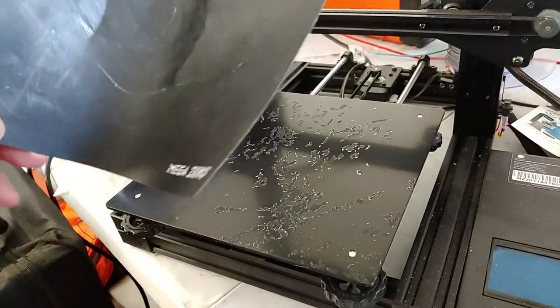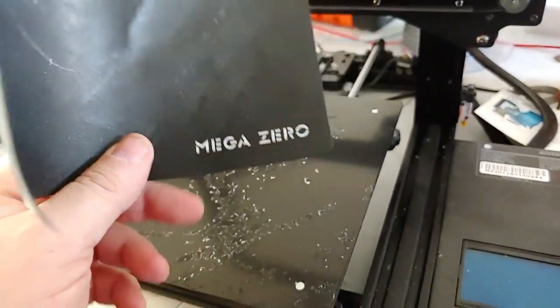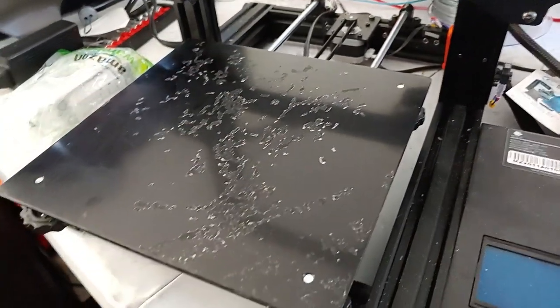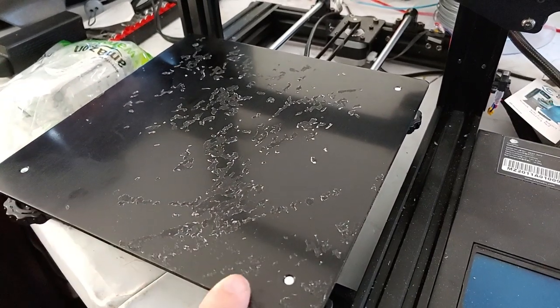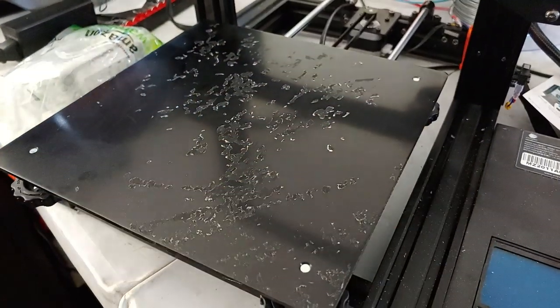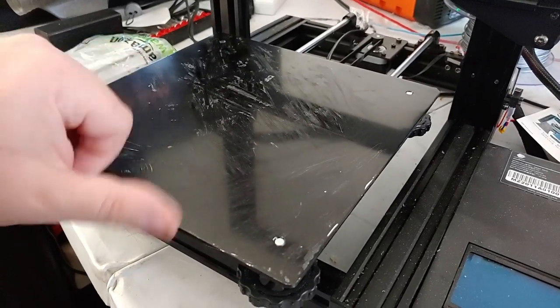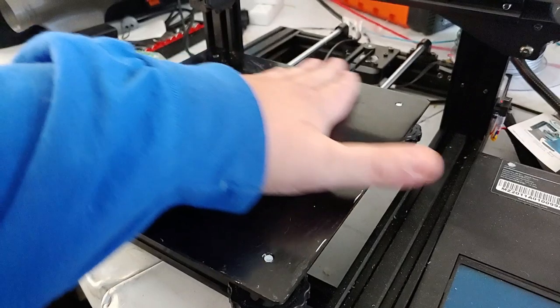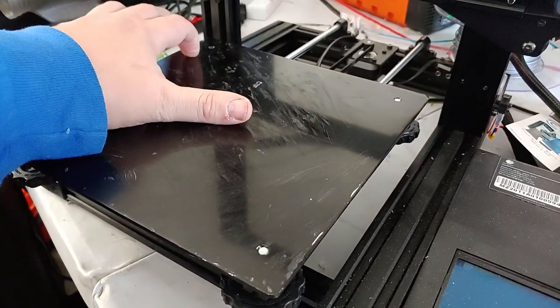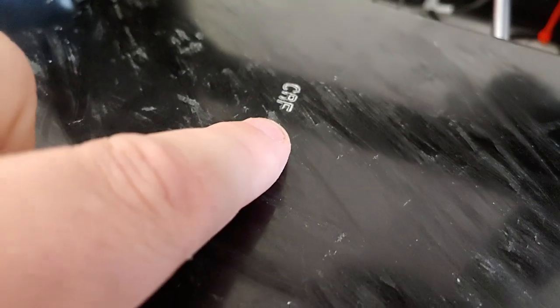The old heat surface is removed. I would actually like to have another one of these so I can put it on the Wham Bam — just to keep that little Mega Zero logo. But the Wham Bam logo is orange and I love that. I have just a little bit of stuff to clear up, so I'm going to take my chisel to it and work this stuff off. Alcohol will help with softening it up, as will Goo Gone. I'm going to clean this up and then apply the new magnetic surface. Surface is cleaned off nice and smooth — there's still little bits of residue, but that'll actually help with adhesion a little bit. There's nothing that'll keep the bed from being level.